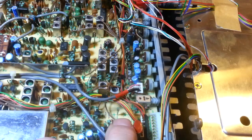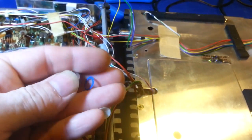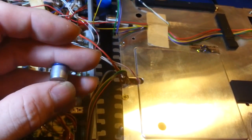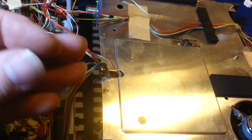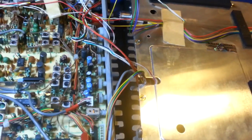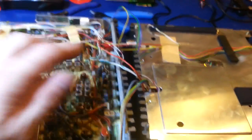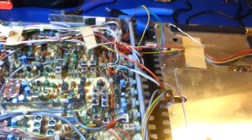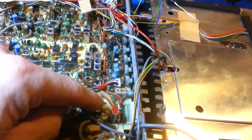It's no longer there, but you can see the battery logo, positive, negative, and the original battery looks like it is a CR, what are they, like CR 1/3, I think. It usually has this little plastic ring right there, because these are solder style. They're meant to have the little tabs tack welded onto them. Now, the proper way to do this is to remove this board. So that's take out all the screws and then disconnect probably 15 or 16 plugs to get this board up so you can get to the underside to desolder those two terminals.